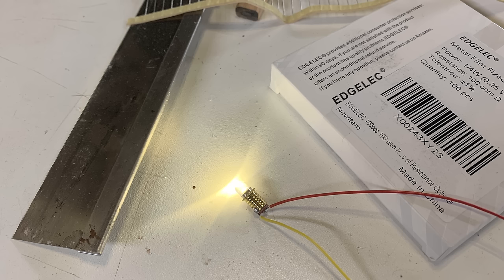Now, unfortunately, we're going to have to get a little bit down in the weeds about switching incandescent bulbs for LEDs, and we're going to cover this in a lot more depth on the Tuesday show. We're going to do a whole Tuesday show on lighting with LEDs. But an LED doesn't function on its own. They can, but for the most part, you're going to have to add a resistor for a load, especially if you want to run these on 12 volts. I've got a pack of resistors here that will work for some LEDs. They're 100 ohms. Sometimes you have to use more like 400 ohms. I digress. But these LEDs with the screw-in base are a direct 12-volt replacement.